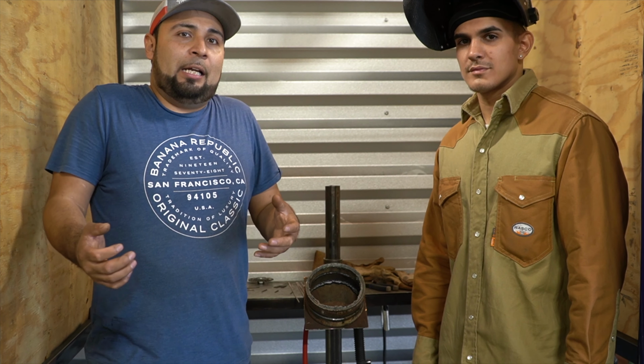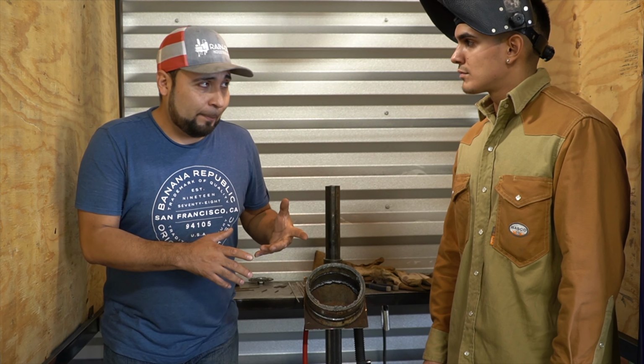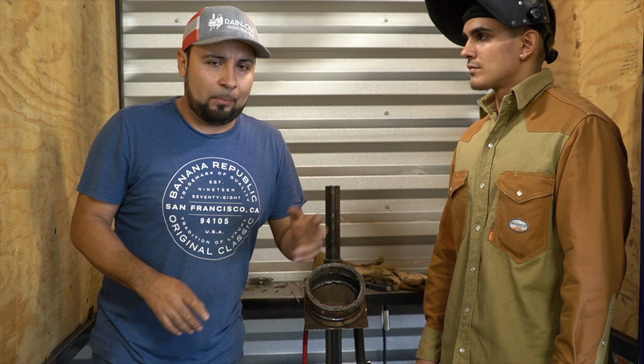So that's good, like I said, everybody that is in welding schools or is learning at home or anything like that, try to tack in position. That's one of the biggest things you can do because you will need it out there. Now, sometimes they have fitters. They have fitter tackers or whatever they call them. Helpers, whatever you want. But they're not always gonna be there. So that's why you need to learn how to tack in position.